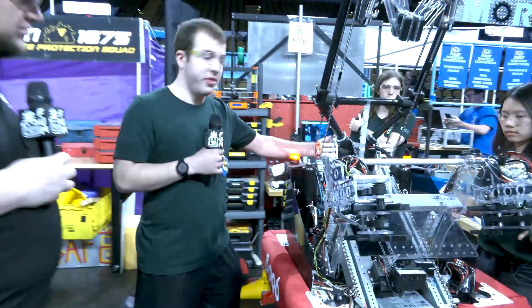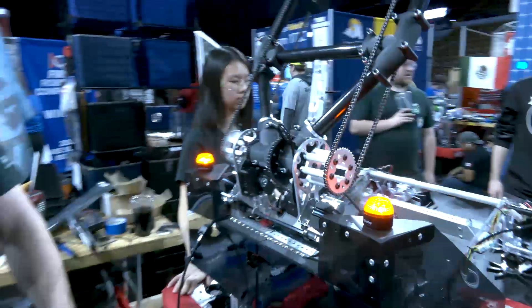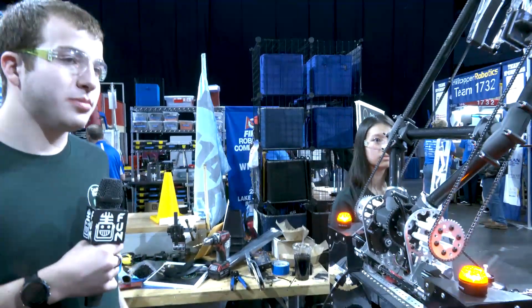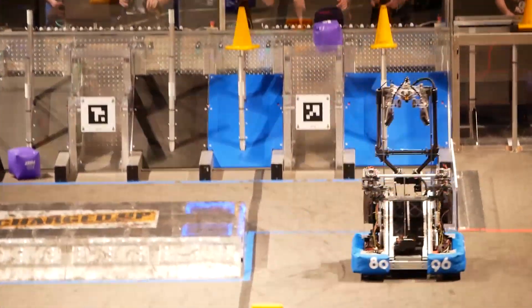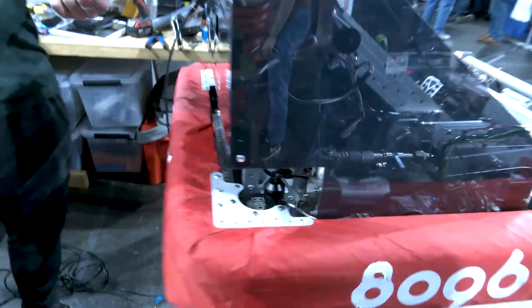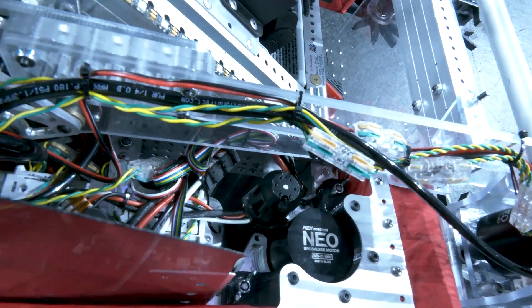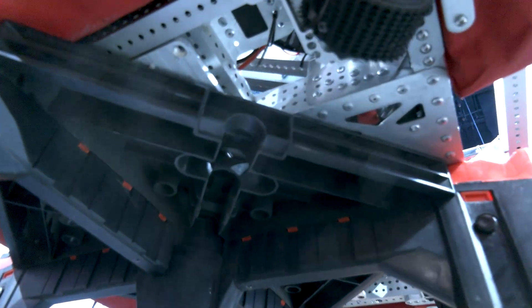We also have absolute position on the arm via an encoder in the gearbox, which comes off with the arm — you can pull it off with two bolts, swap in a new one, and the zeros stay the same. On the drivetrain, we're running a custom swerve. We wanted to be small to fill the charge station and fast and maneuverable. We based our module on Rev's MAXSwerve but made it about half a pound lighter, and we use a one-and-a-half-inch wide tread for less wear, more grip on the charge station, and better overall performance.